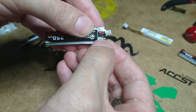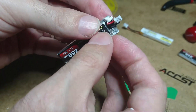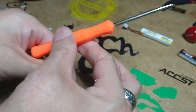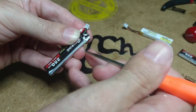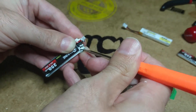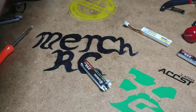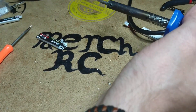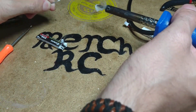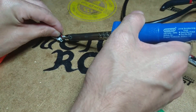If you look closely, you can see the silicon is all over the place and it's really hard to get off. What I usually do is just pull it up a little bit. I wouldn't use something metal — use something plastic or even wooden like a toothpick to pick it all off. Get as much as you can off, and you'll see what happens when I hit it with the soldering iron. This soldering iron cost me about twelve pounds and it's done everything I've needed.